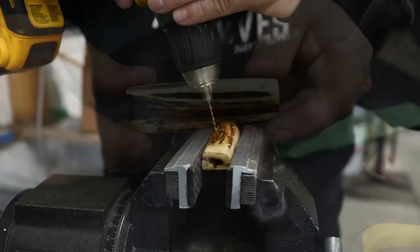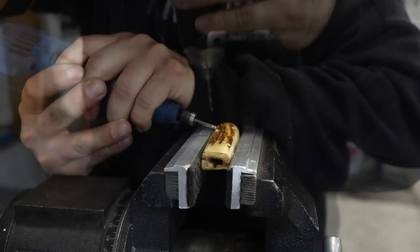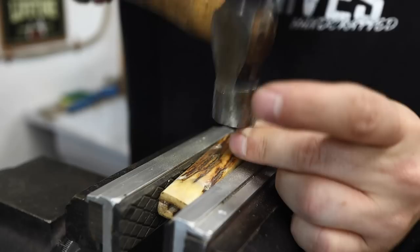I'm going to start with a drill bit to take the bulk out of the pin heads - these are pretty thick. Then I have a diamond-coated spherical head on the Dremel to carve off the last little bit of the flange on the pins. Then I'll use a nail to try to drive them back through, since all of my punches were bigger than these little brass pins.